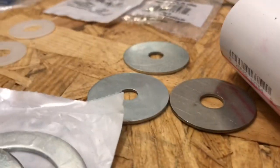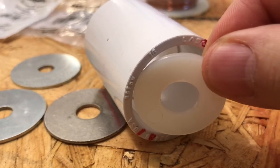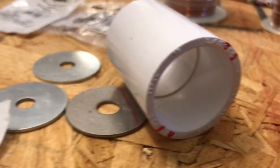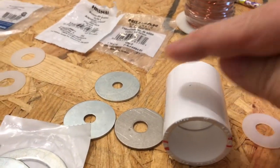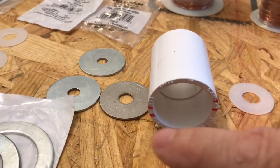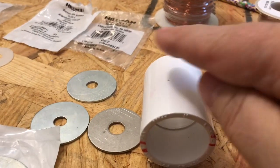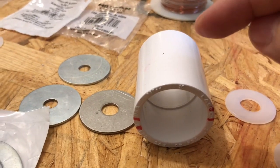Because the magnet is only one inch in length, we can actually insert it into the tube or pipe on each end. So that's three coils — one coil, two coils, and then three coils. The wire gets wrapped around this way, the front coil is wrapped this way, and the back is wrapped that way as well, so they're all wrapped and pointed in the same direction.